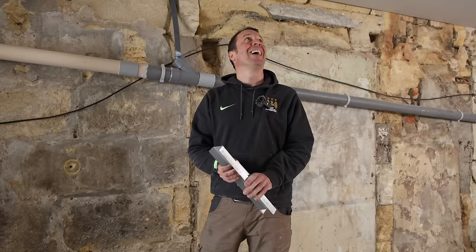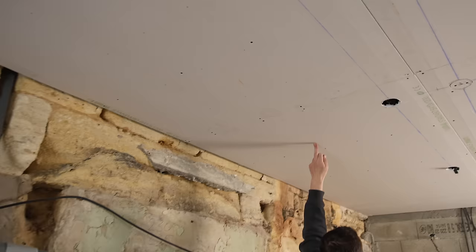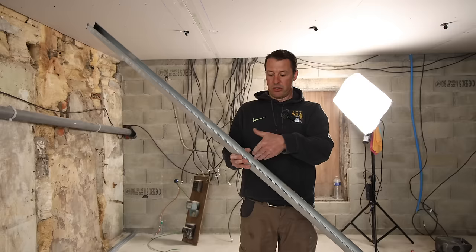And normally, this is a piece of board, like I said, 1.20 meters wide, so it starts here, finishes there. On the wall, you see that dot there? All of these plasterboards have a dot along them, and that dot is in the middle. Yeah, okay. So it's at 60, so you know where to screw the board into. Okay. And the rock wool that goes with these rails and montants is 60 centimeters wide as well. So the insulation fits in there and doesn't move. Okay, right, let's get on.